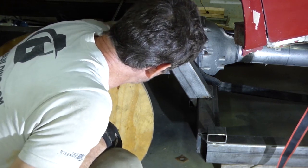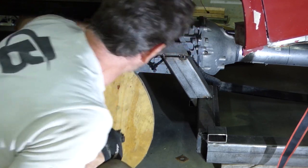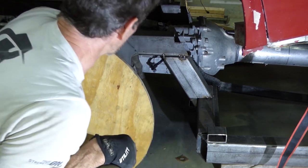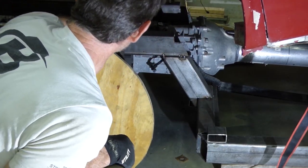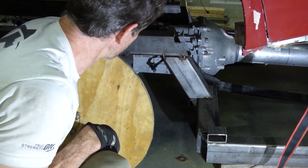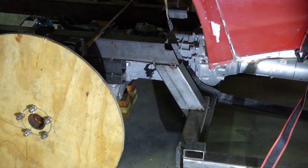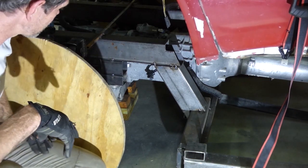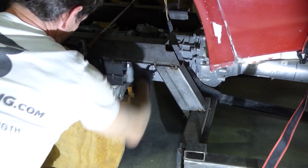I've got just a little bit of an overhang off this upper frame rail and I'm going to box this thing in - weld it up, cut off the excess, and put on a close-out plate on the front to close that in. I still need to finish welding all the other pieces, and I need to do some stuff with this drop over here on the side - this is the drop for the chassis mount. I'd like to extend this all the way over to the upright to give it more support.